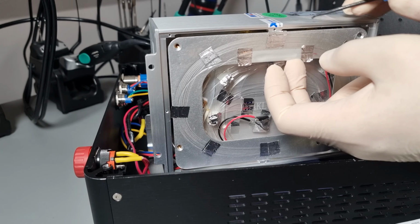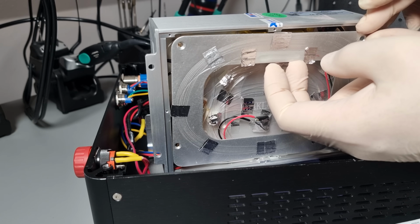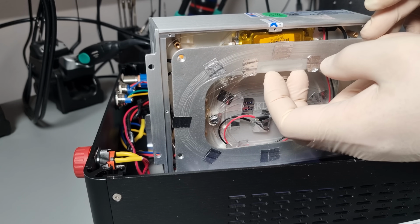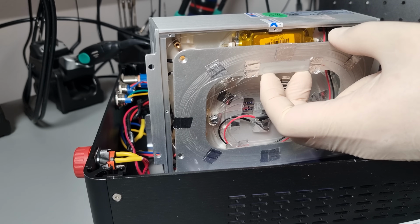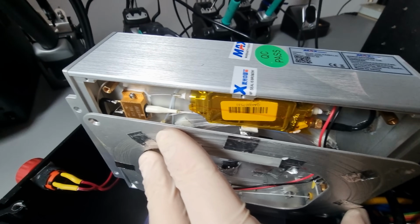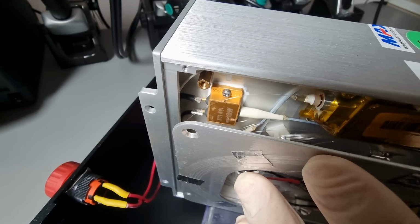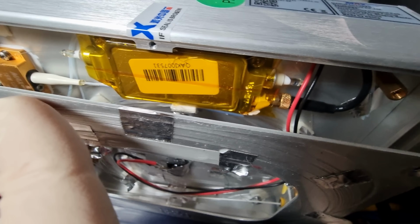The coax cable that we've seen leave the mainboard on the other side of this module could either go to a seed source, a fiber laser that's good at producing impulses, which would mean MOPA, or to an acousto-optic modulator, a Q switch, a crystal that just isn't very transparent unless tickled by its favorite frequency. It is obviously the latter, because the recipient of that coax cable starts with Q. And it has a fiber in and output. The seed source would only have one output. So this is a Q-switched something doped fiber laser, and my curiosity is satisfied.